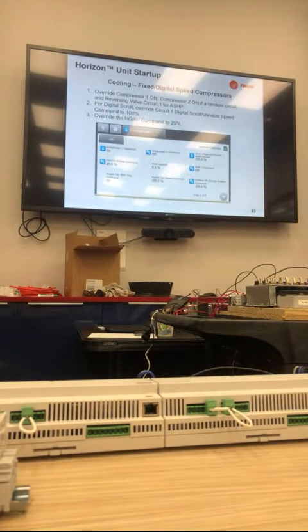So for the startup, here's where it's going to vary on everybody. Again, with Trane pushing the new 45 is the new 55, and with the cold temperatures we're trying to do off the evaporator and the amount of reheat we're needing, we have to change our charge. We're needing a lot more refrigerant for it to balance this system. So what we're asking for is to turn compressor 1 on. If it's a tandem, you turn both compressors on.